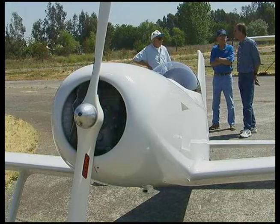What Bruce is saying is that as long as you can put a flat nose on a streamlined body, as long as you fare the edges, fare the corners back, like, for example, you would see on a NACA radial engine cowl, that very nicely developed curve back from the flat face, there's no difference in drag so long as the wetted area remains the same.